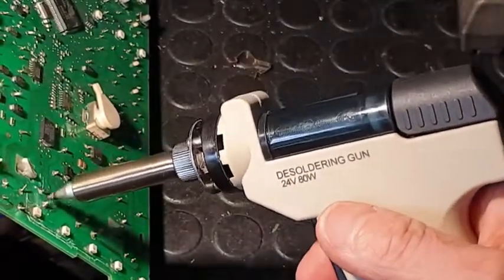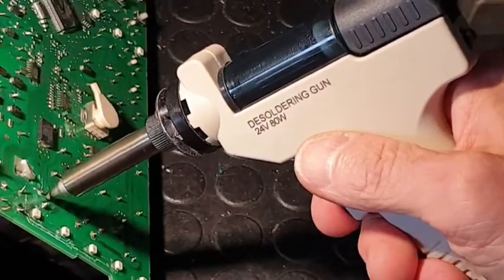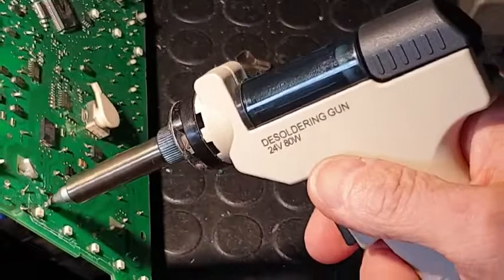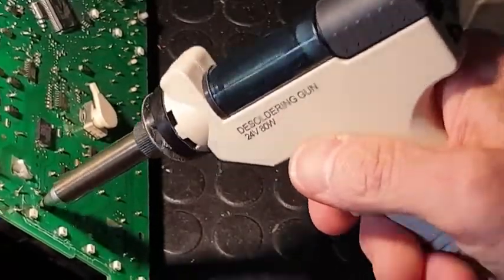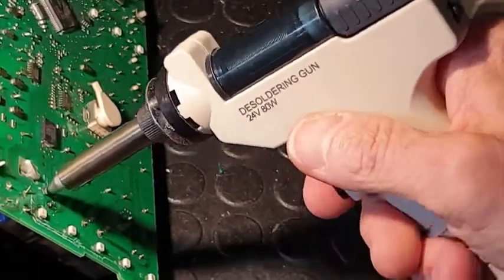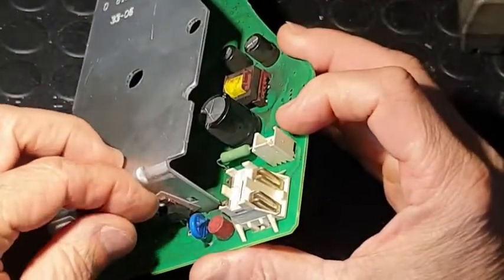The part can obviously be purchased online for those who can wait. IGBTs are sensitive to heat and static electricity, so I'm using a desoldering vacuum pump to suck the solder out of the joints. Now that the solder is all out, that IGBT should come out quite easily.